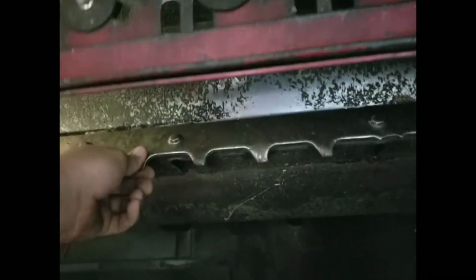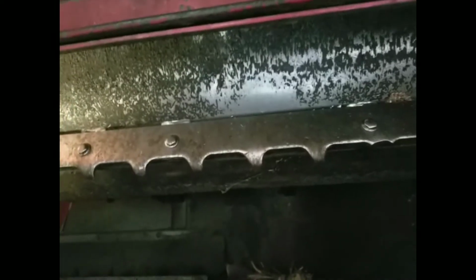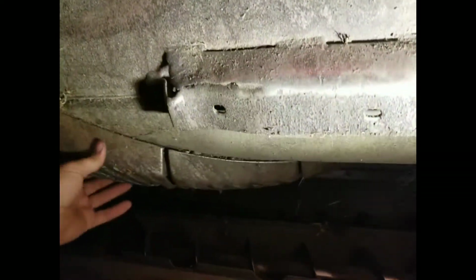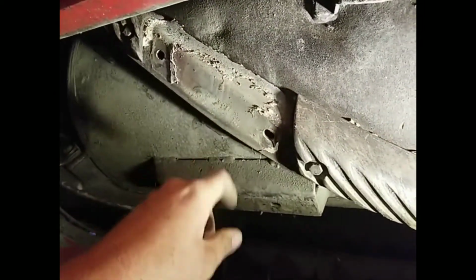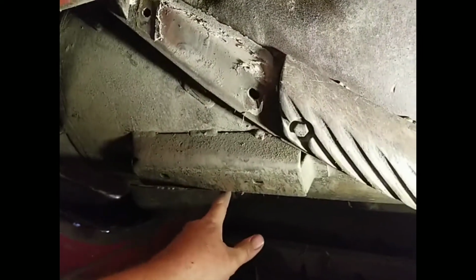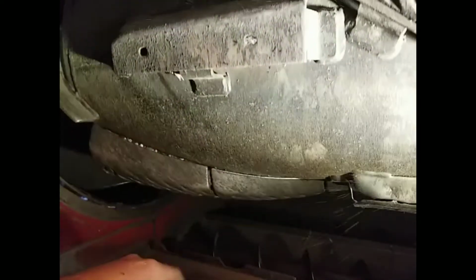So while it's in here, we're going to do rasp bars. We're going to do the crop flow bars. I've got them new leaning up against the bench over there. So what I'm going to do is I already started here, and naturally, because of the balance of the rotor, where did I start? Oh, I started here. Naturally, with the balance of the rotor, it's going to want to find its own balance with that one being off. So I'm going to start in that row and just change them, and then we'll move to another row and change the other row.